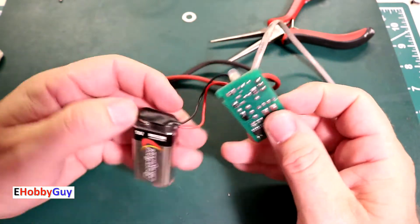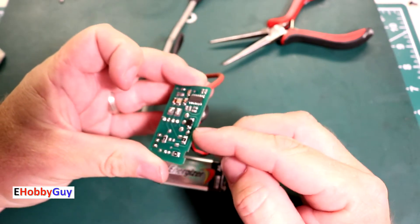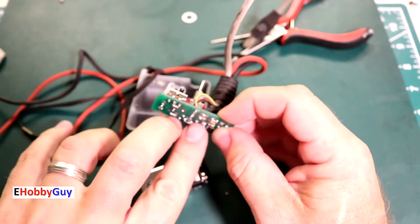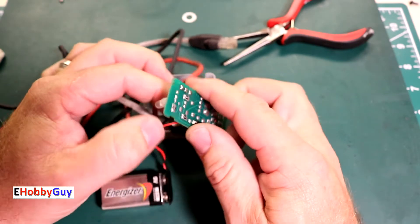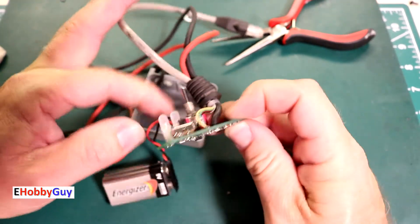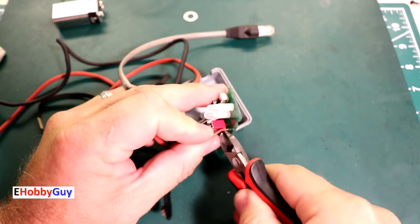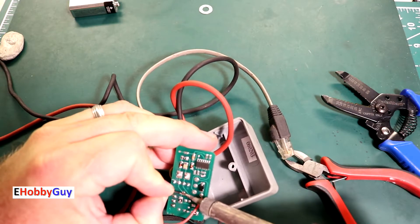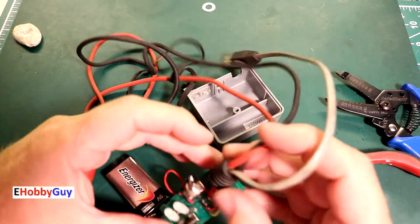Now we have to look at this power wiring — it looked sketchy. We have these push-on SMT connectors, one for positive close to the edge and negative on the other side. I am going to cut these and re-solder the wires hard-soldered directly to the board, coming out the other side, eliminating any contact issues from a potentially loose connection. Cutting the positive — that is one done. Fast and slow tones are still present. My next mission is to check if the intermittent issue remains, so I will turn the lights off and see if I can make the flicker happen again.